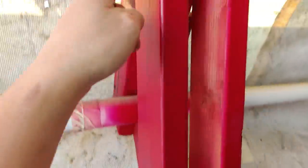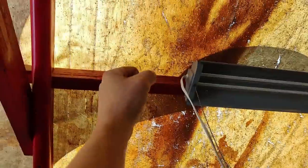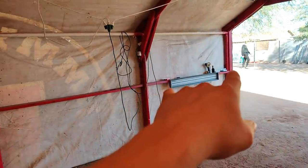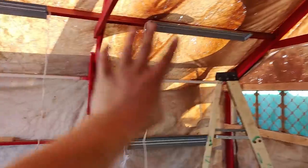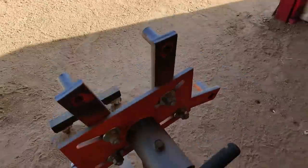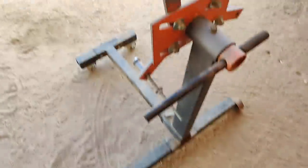I'll probably cut this off short right here, then run the wire and wire nut it together, tuck it back in behind here, and use this wire to route it nice and clean up to the next light and connect them. I'll jump that light to that light, have a pigtail coming off of that one running nice and clean, and tie all five together on this side, then all five together on the other side — so it ends up being just one line going out for these five and one line going out for those five.